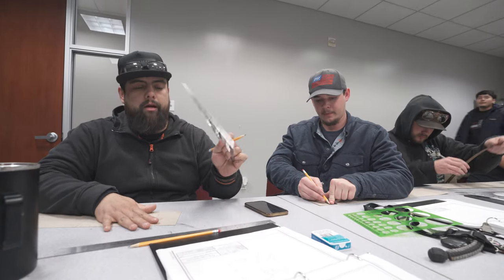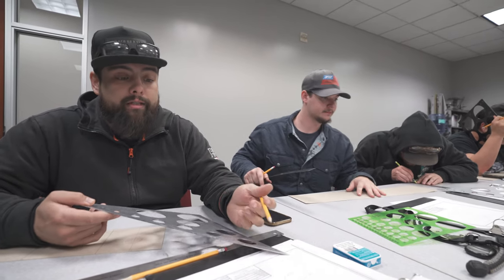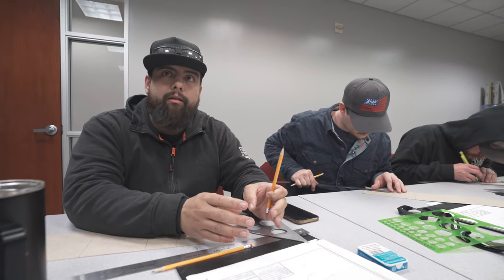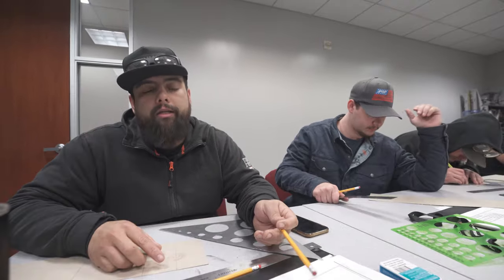Who's making tabs? Making tabs — reading an engineering drawing, finding out what the dimensions are from what's given to us on said engineering drawing, and then translating that into chipboard. Then you're going to make a template, trace that out on some metal, and cut it out. The test is seeing how that piece fits into a buck or a jig — it has to fit perfectly into the pattern the teacher gives us. In a situation where you don't have a computer or CNC capabilities, this gives students the ability to read an engineering drawing and make a part from scratch using these old-school methods.